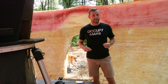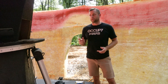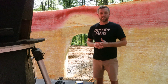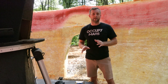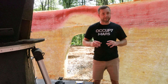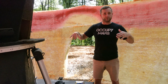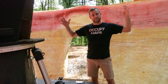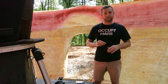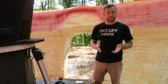Moving forward, I'm going to try a couple of different strategies. I wasn't too thrilled with how the foam print came out. I'm going to need to buy an expensive foam proportioner that mixes the chemicals exactly. I did some tests with my current system and was getting way off proportion, which was causing inconsistencies in the foam — it was just squishy. A couple of layers of squishy foam led to huge problems later on. As I added weight, it kind of shifted everything. I need really consistent foam — if mixed with proper proportions, it's nice and sturdy, hardens quick, and expands at about 8-to-1 expansion.